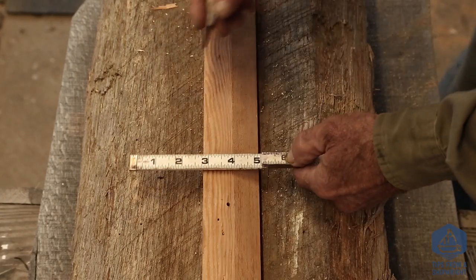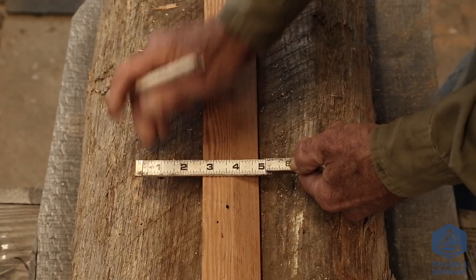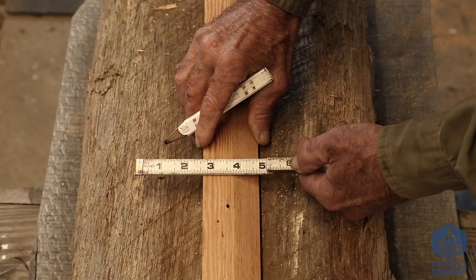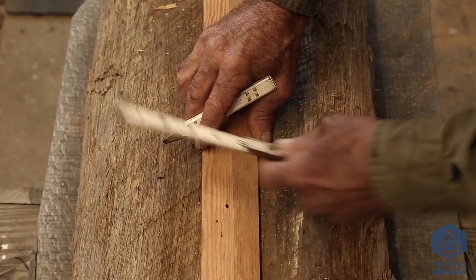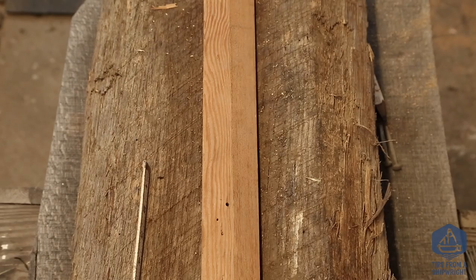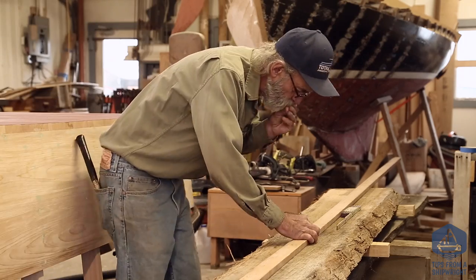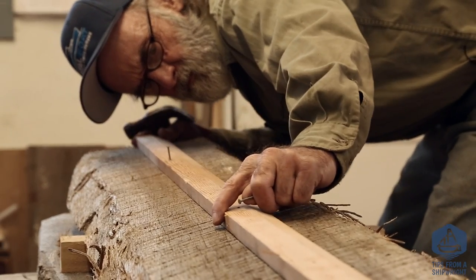The first thing I'm going to do is place a six-inch rule right here over the top of this batten and center it right in between the sapwood. So we're going to cut it right about here on both sides. But my circular saw cuts an inch and a quarter or so away from the line, so what we're going to do is move that batten over to four and three-quarters and nail it down right there. I'm going to put a little pencil line there so I don't lose track, then take a four-penny finish nail and tack this batten right down — and then go down to the other end, do exactly the same thing, sight it straight, tack it down, and use that to run the skill saw along.